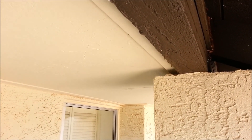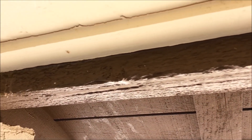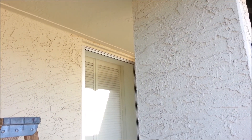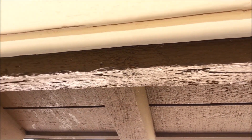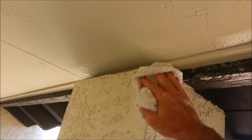Because any honeycomb and dead bees that you don't get — the beeswax is going to start to separate immediately and go wherever gravity takes it. In our case it's coming down at an angle, and we're super lucky there's a nice gap right there and a tiny gap all the way across. It's big enough for the beeswax to seep out easily but not big enough for bees to crawl back up inside. So it's perfect. I've been coming out here every single day with warm water and dish soap, wiping up the beeswax.